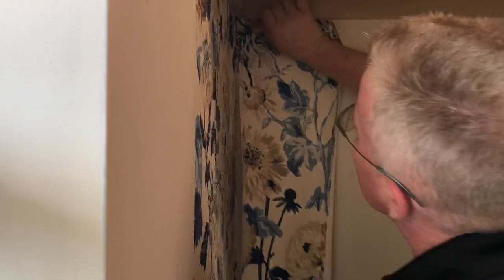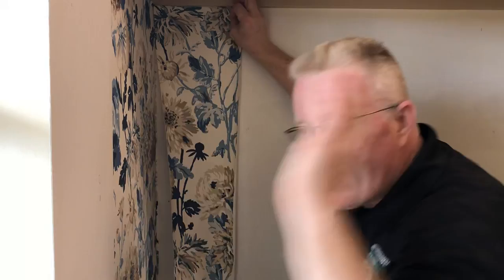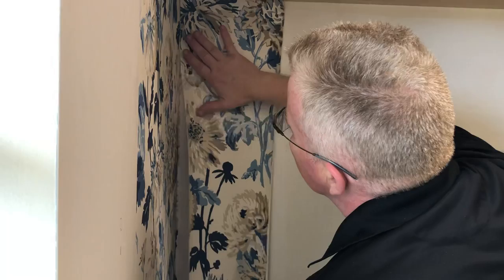Okay, so you're overlapping. Now you can understand why my cameraman is where he is — you're looking at this wall. The adjacent wall has an edge and it needs to go under this wall, because when you look head-on at the wall, if you see the edge of the overlap, the overlap should face away from view. That's the rule. So I have this under here — we're going to move it over, that's all.